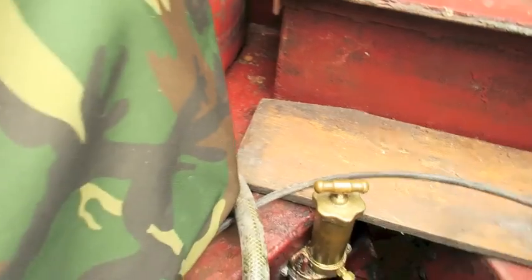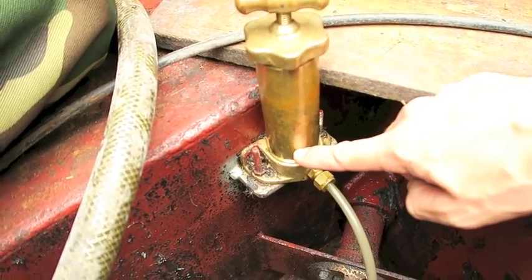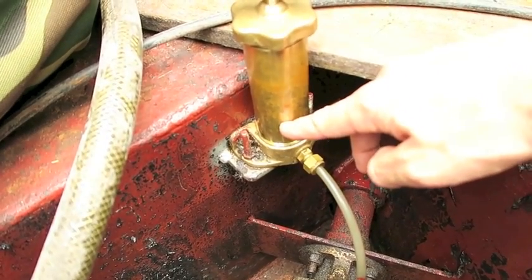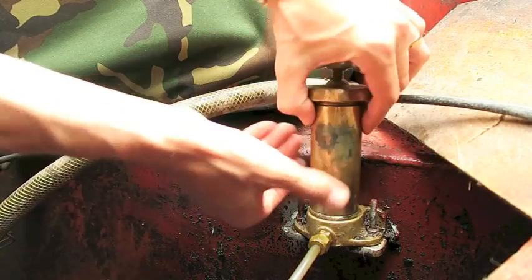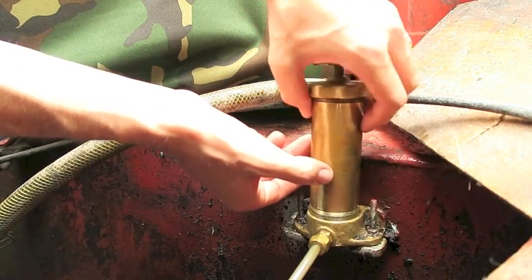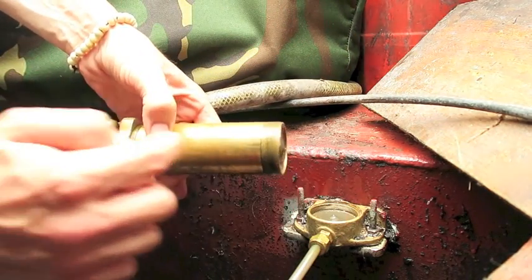This will just make sure that I don't get any grease all over myself as I'm doing it. Now, I don't unscrew this — at the moment the grease plunger has pushed grease all the way down. If you unscrew this, you're going to end up pulling grease back up through this tube or possibly developing an air pocket. You don't want that. I would unscrew this entire tube, which I'm going to do now. So the whole thing comes away, and as you can see, the grease is right down to the last of that plunger.